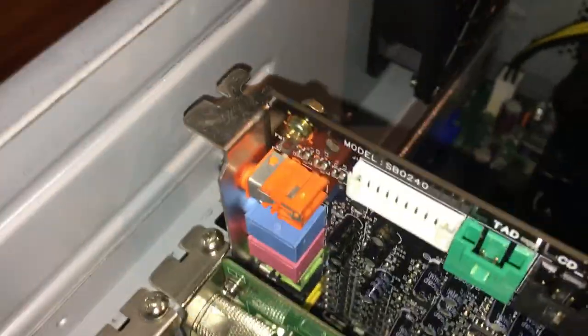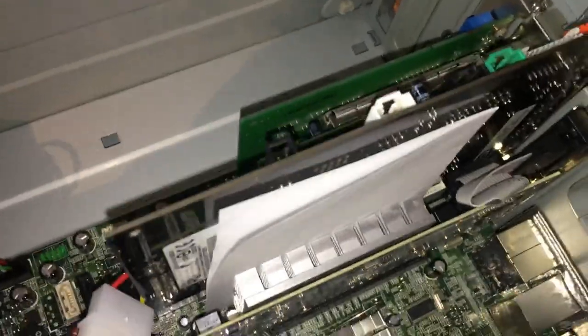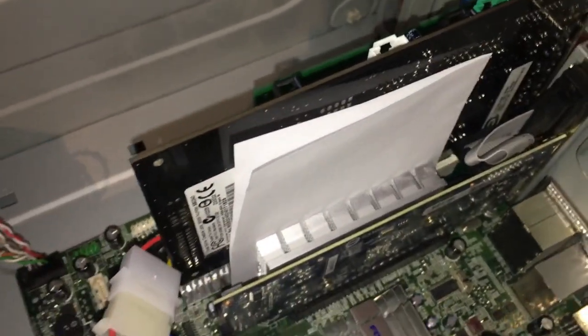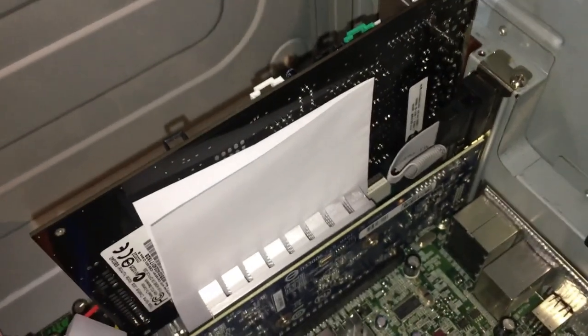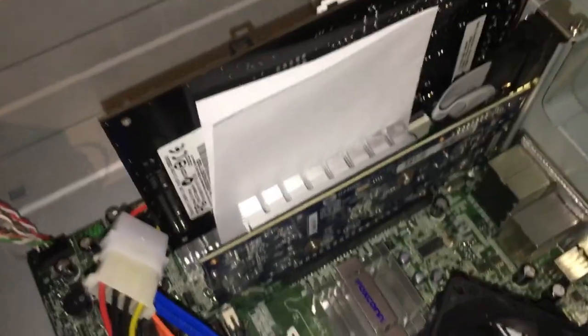Or when you're getting a case, you can get a new case and try to deal with a case that's going to have this geometry — it's sticking up higher than the card slot, and this is going to be problematic. Another thing is, you see this heatsink on that video card — when I'm testing the slot, it seems to be almost hitting the next card, so I'm just going to note that because any type of contact between traces in the computer can potentially destroy something.